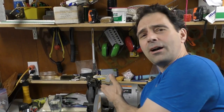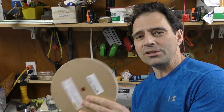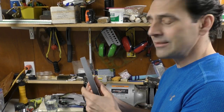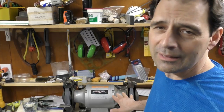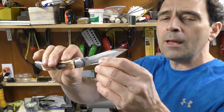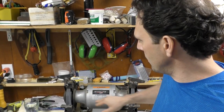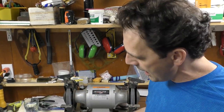You may ask if I already have a bench grinder with stone wheels, why would I need a paper wheel? Well, the paper wheel will just get the blade that much finer and it will get you to that razor edge. The current fine stone wheel is about the same fineness as the coarse grinder that comes with the paper razor edge wheel. The coarse blade is really only for taking a lot of meat off of the blade - for like my lawnmower blade. I put a new curvature on one of my hunting blades and honed it on the fine stone blade, but it won't get razor sharp, so now I'm moving to the paper wheels for that extra fine tuning.